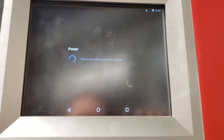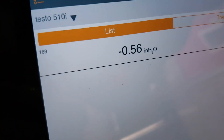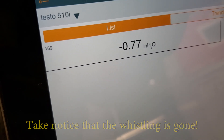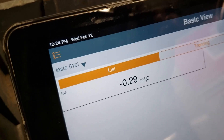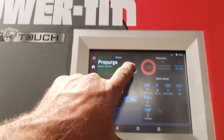Let's give this unit another try. There she goes. It's reading 0.7 inches, supposed to be 0.8 inches — but that's sure better than about negative 4 inches of water column. Now it's going down below the light. Much, much better.